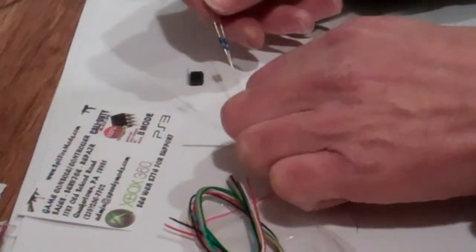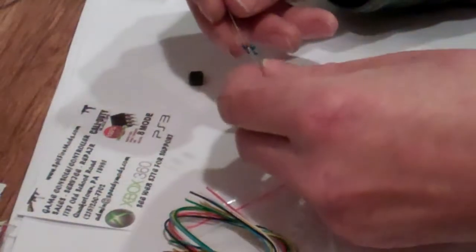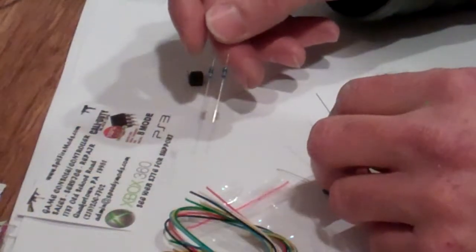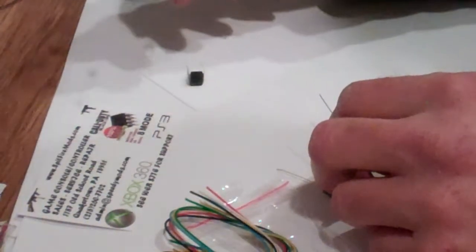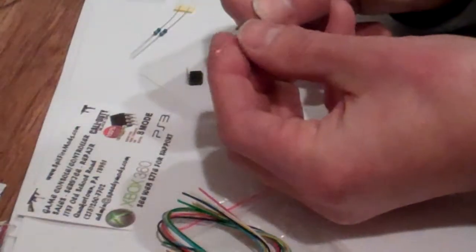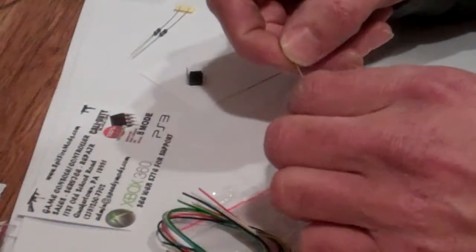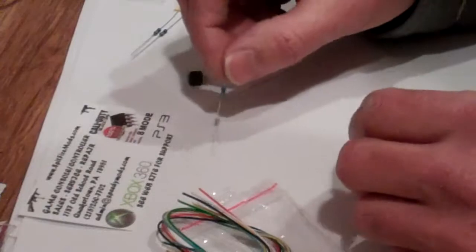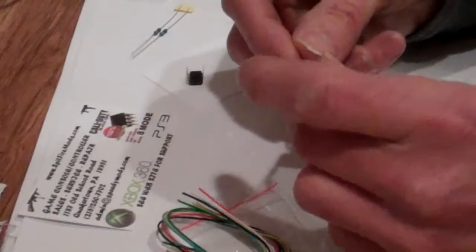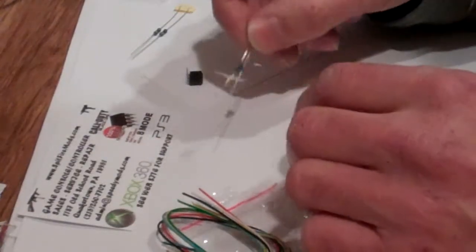Along with that, you'll have two 330-ohm resistors and a diode for the matrix boards. These two 330-ohms will go to your triggers — your right and left triggers, in line with your right and left triggers. The diode, along with the 1K resistor, will then pull the voltage through the LED on the matrix, or with a CG controller, you would just leak the voltage through with the 1K, and that's how you'll light up your LED in the case of using the mode indicator and the flashing in between modes.